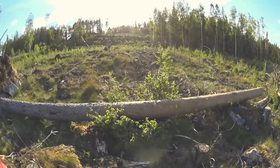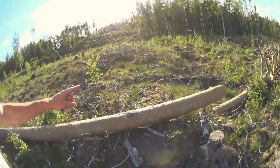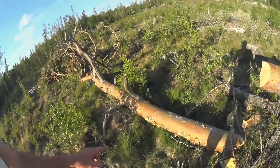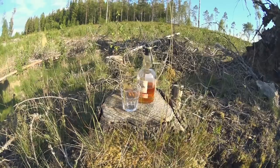Here's the tree. There's three sections here. I'm gonna start with the upper part which looks the straightest and without knots. Order of operations: first I'm gonna cut out a couple of pieces from the rest of this tree to use as a support box to put the log on. Then I'm gonna cut off the section I need and square off the ends for better marking. Prepare for celebration or drowning my sorrows if this doesn't work.